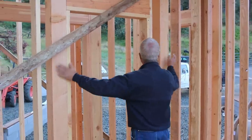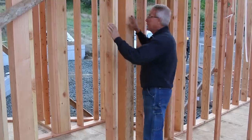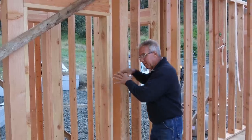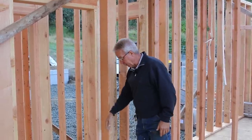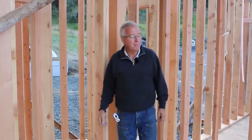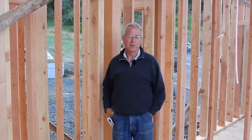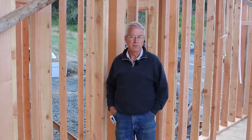We've got two more posts down here — this one stays where it is, this one has to move just a little bit, and there's another one that's got to go in. Where the garage ties back into this end of the house is fairly tricky in terms of transferring the loads from that garage ridge down onto the beam underneath. Posts happen, beams happen, bearing is important. The last thing we want is drywall cracking and creaking sounds in the middle of the night. We want this house to stand here straight and strong for a good long time, and the components of this framing package are ample to make sure that happens.